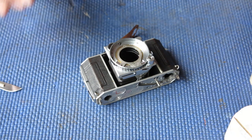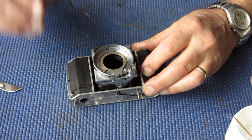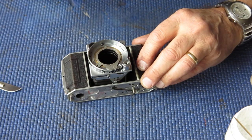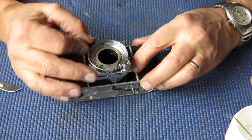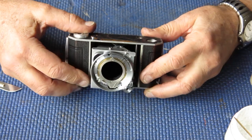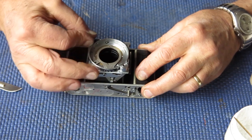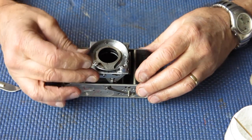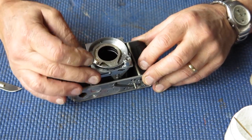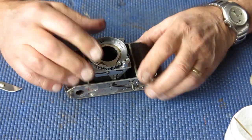Alright, it's some indeterminate time later. I'll be able to check the timings on the camera files and tell you that possibly. I've had everything out of here. The struts have all come out of the camera, been cleaned up, straightened up, put back. Likewise the focus helical's been cleaned, lubricated, everything's working nicely.